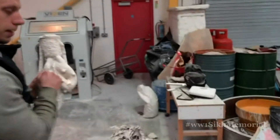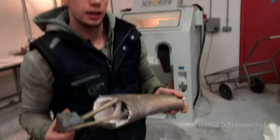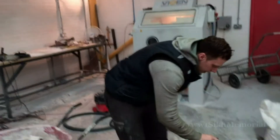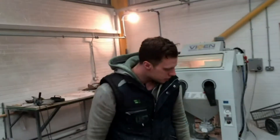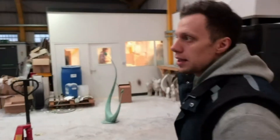You might see one over here. This ceramic shell is smashed off, and you're left with your raw form of bronze casting — your shape that the metal workers are then going to take over and work with. The runners and risers are cut off. We've got a sand blaster here; you can blast all the remaining debris off.